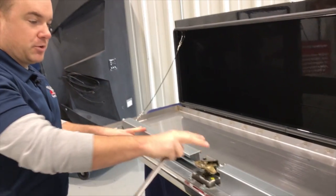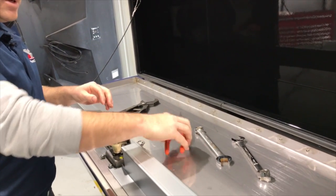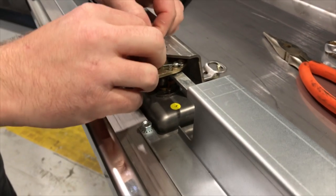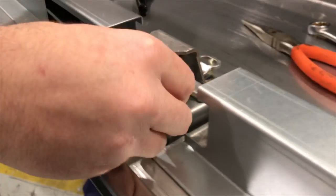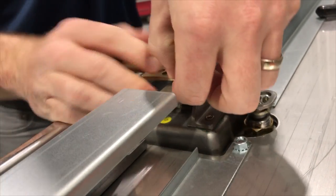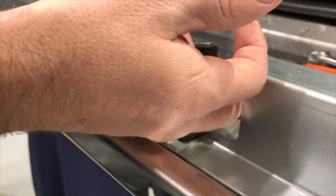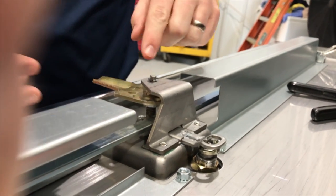Once those are in spot, we're going to move into the middle latch. To do it we need a couple of 17mm wrenches — needle-nose pliers help too. There are some cotter pins that hold the three-point arms to the latch assembly. We're going to hand mark the holes in this plate so you remember exactly where they go in. I'm going to slide the three-point latch arms up through the latch a little bit so it's not interfering with our ends while we try to adjust this.